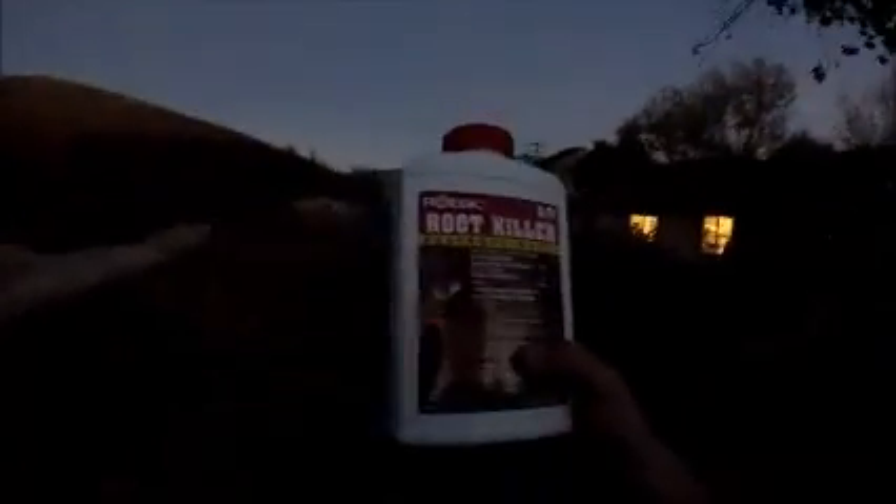We've made the executive decision to just treat everything tonight, because we've got to let it sit for four to eight hours anyway. Everyone's not using the water already, so we'll stay on that program. We're going to put in the Aerobic Root Killer Destroys Roots — this is a tank treatment. We did the foaming treatment over there and had water flow back pretty rapidly, which is concerning, but the treatment's down. I stopped the flow of water, so hopefully the treatment will start doing something. We've got a little bit of roots left and debated fishing them out, but we're going to treat everything now.